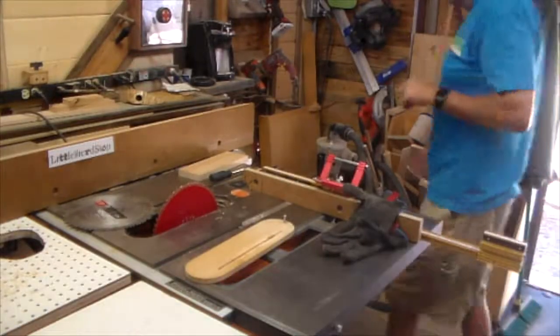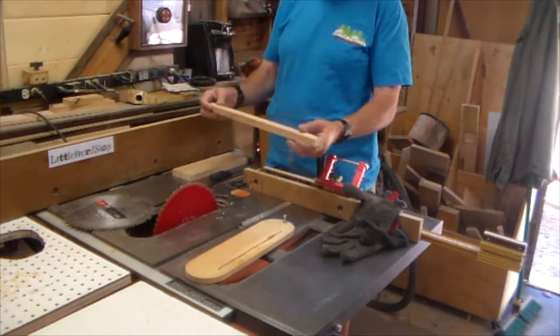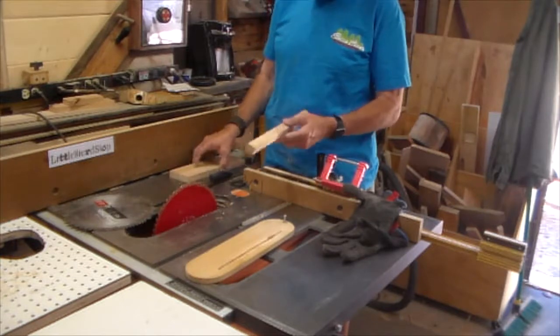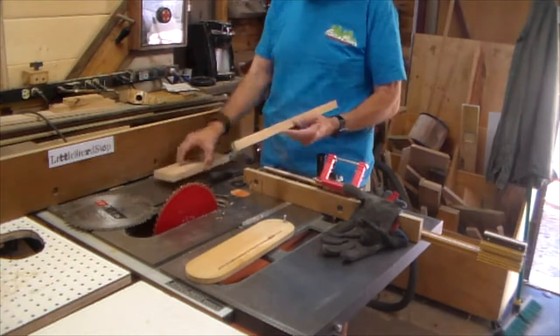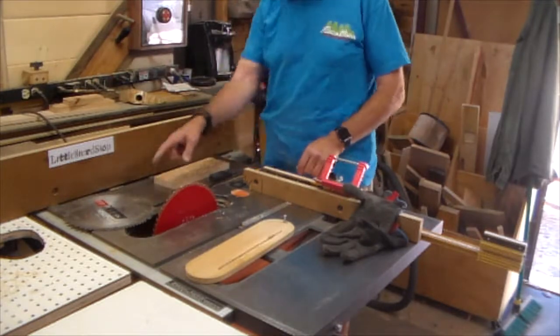Okay, I've got the two lower supports here taped together. I've got to cut a half lap in them. Insert this cross brace between the two legs. So I got to cut halfway in that, halfway in this, and it'll go bottom of the shelf, go up in the cross piece. So cut those half laps. I'm putting on my square tooth blade.